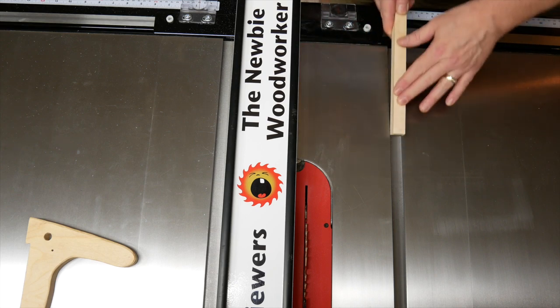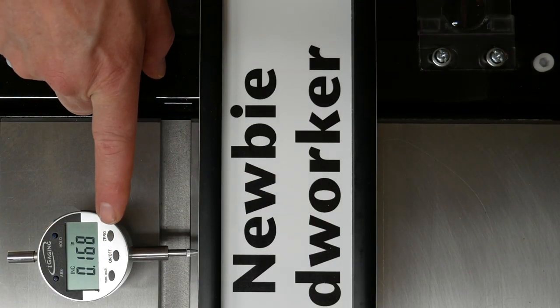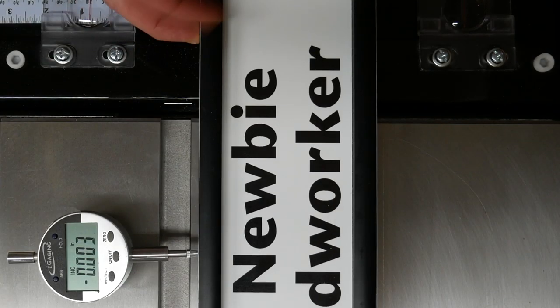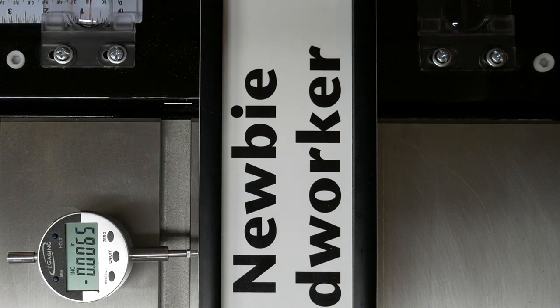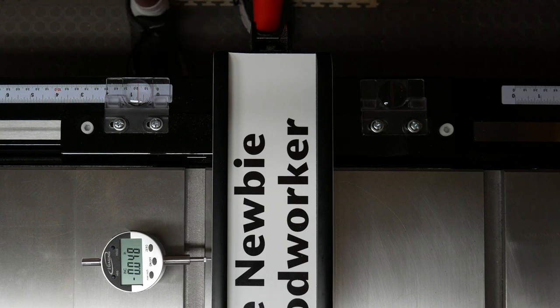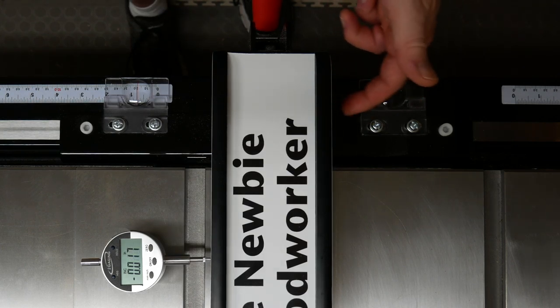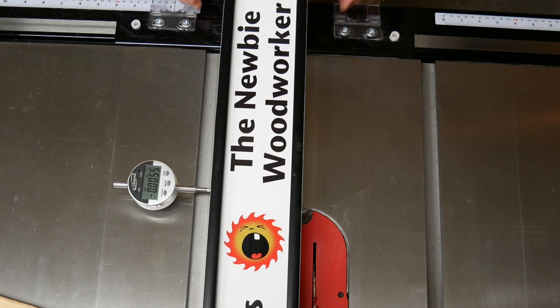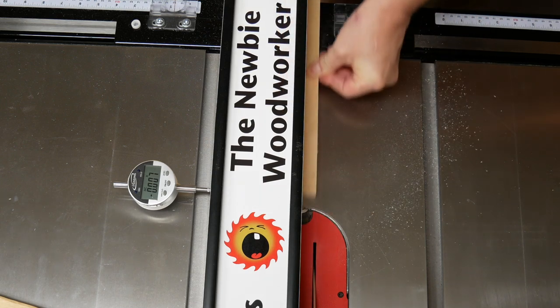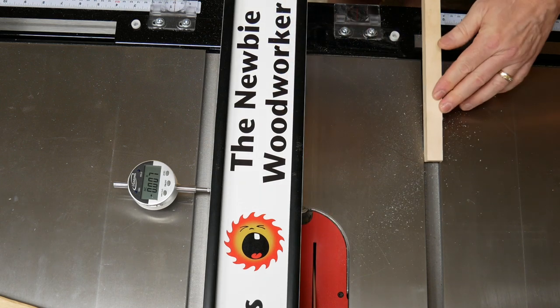But before I show them, this is how you use them. Cut your piece just a little oversized. Without moving the fence, position the gauge and zero it. Then unlock the fence and tap it over a little. The gauge gives you tangible feedback of how much you moved the fence. It's not so much about the exact number, at least not until you're trying to shave that last little bit off. It's mostly about did you move it at all, or did you move it way too much? And if you did move it too much, the gauge makes it easy to move it back and try again. Make a test cut and see how close you are, and repeat if needed. It usually only takes me two or three times to get it right.